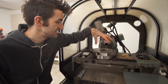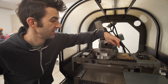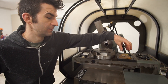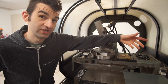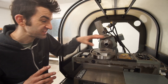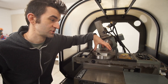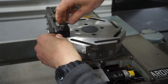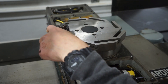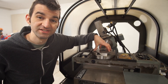The very last thing to do is this air turret. This is the eight-position turret. Basically what it does is it pops up, it rotates, and then it pops back down. There's a magnetic-based positioning system — it's actually an air-driven motor, like a worm gear that spins this whole contraption, and another air cylinder that lifts it. They work in unison. That's going to be the most complicated thing because I'm going to have to probably put some dedicated electronics on this just to run those solenoids correctly, so that during a tool change it pops, spins, and then drops and locks. I know some people have removed the air motor and just put a stepper motor on here to index it, but the air motor is actually pretty cool and really fast, so I'd like to try to retain that.